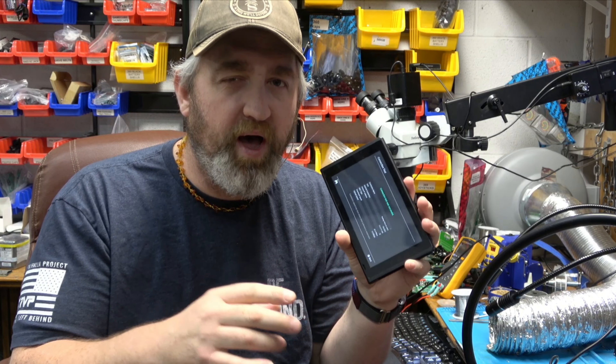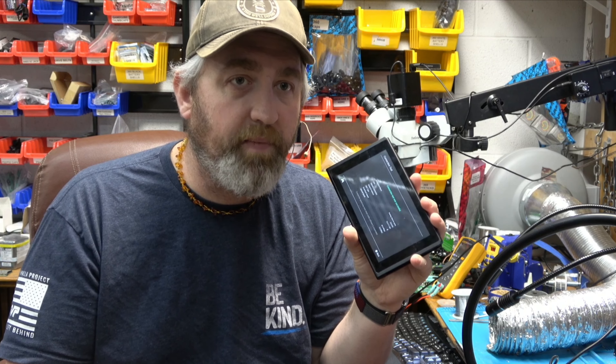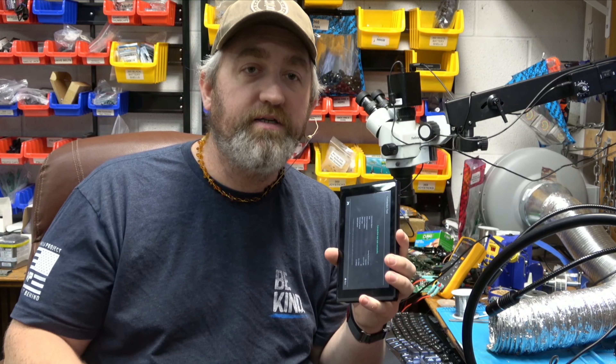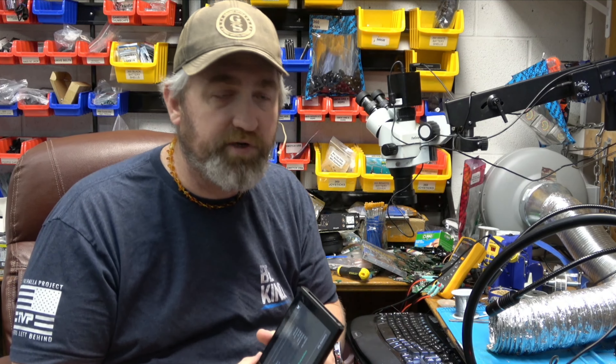If it's not a success for you, then you need to remove the Wi-Fi chip and reball it or replace it to go that avenue. But since that's a big time suck and kind of a pain, it's worth trying to just reflow it first and see if that solves your problem. Thanks for tuning in — if you like the content, hit the like button, drop a comment, and definitely subscribe. Appreciate you.